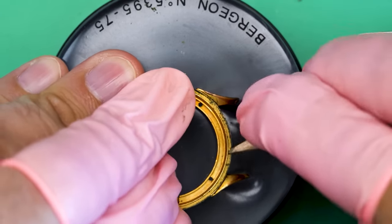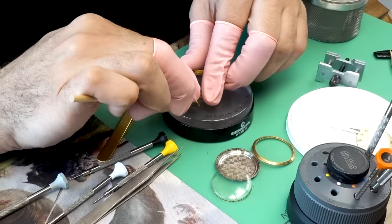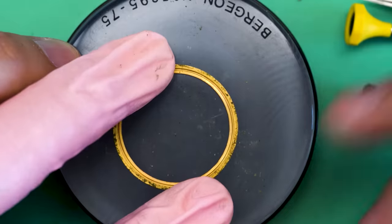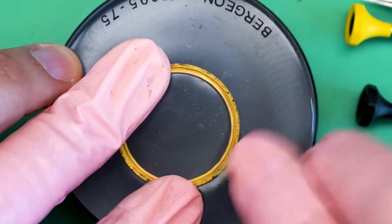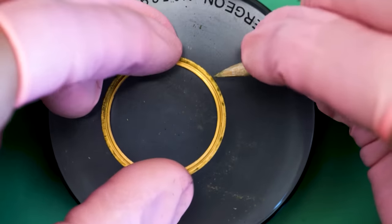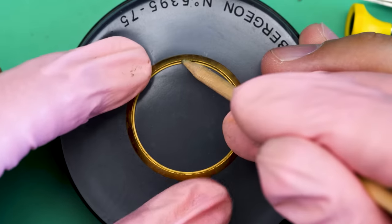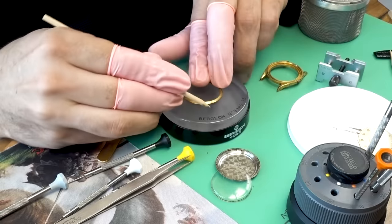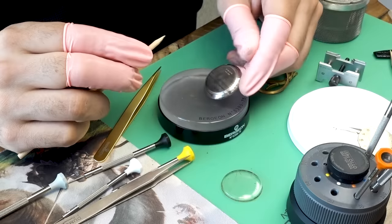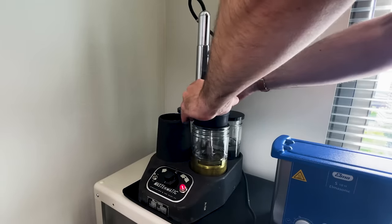So what I'm going to do is put it in my ultrasonic cleaner. But before I do, I'm going to take a piece of pegwood and just start to work my way around the edges where there's really hardcore caked-on stuff, just to try to loosen it up a bit so the ultrasonic can do its thing. That is a lot of gunk under there. But it also gives me some hope for the watch — if it looked pretty decent when it was this dirty and there was this much junk under the bezel, imagine what it could look like after a real cleaning in the ultrasonic. I'm making sure to get any dirt out of the inside of the bezel as well. There's also a little bit of rust or corrosion on it, so a quick pass with pegwood and we're ready to put the watch into the cleaning machine.